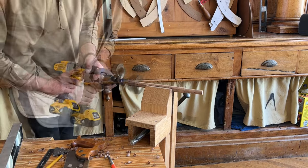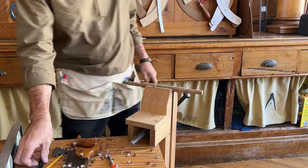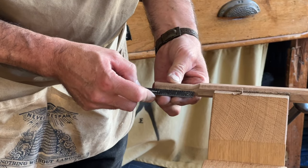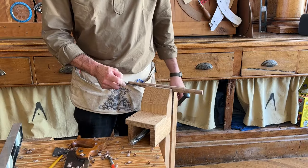Let's test that. Now I'm going to check — and it's starting to rise up right there. So two and a quarter. Now every tenon I make should be two and a quarter inches long.